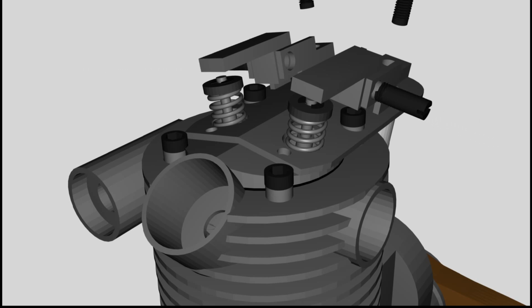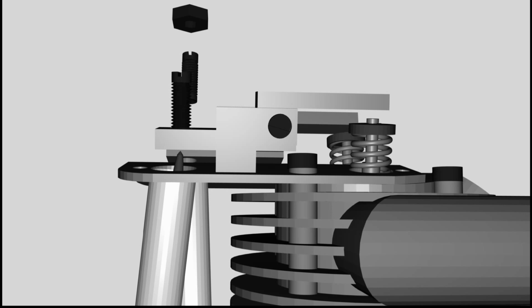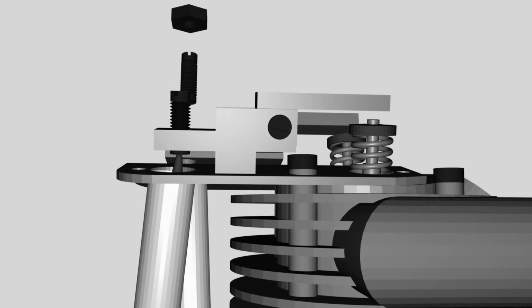The poppet valves are opened by the camshaft via the rocker arms and the pushrods. The closure procedure is done by the coil springs. There has to be a small gap between the rocker arms and the top of the valve rod, while the camshaft is at the position closed, to ensure that the valves are closed properly. This gap is called valve clearance.